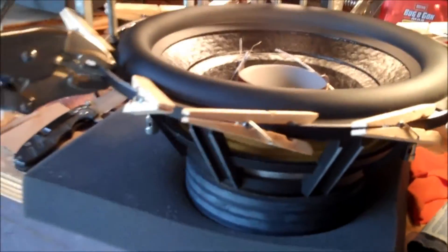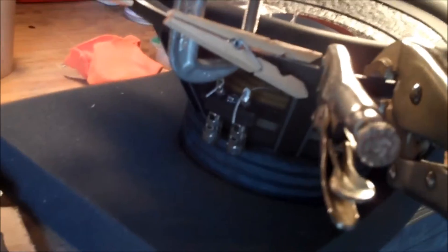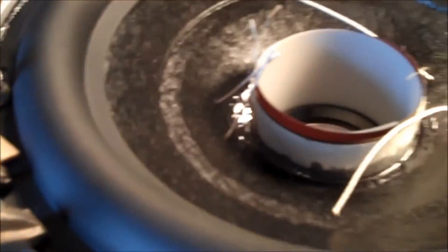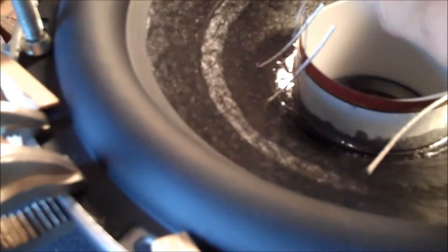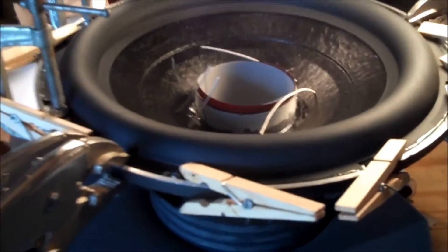I thought I'd take time to start soldering the terminals — I've already done these two. The idea is to flip them so they naturally want to go up away from everything. They already have a natural curve in them, and if you can spin them while you're soldering a little bit, you can get them to go up. Hold it and as soon as the solder cools off it will hold that stance. Up here I left everything — I'm going to do this later so I don't bug any of the adhesives, then get those trimmed up. I left quite a bit of slack, and when it's time these just get folded over and soldered, then you cut off all the excess.